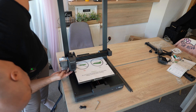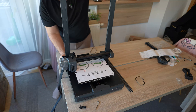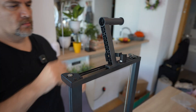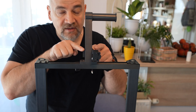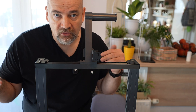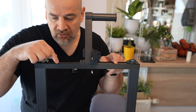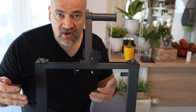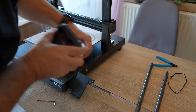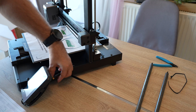It's time for installation. The nozzle is in the way, I have to lift it higher. Installing the spool holder — just a small lock. The holes are in the center of the spool holder part, but the spool itself will be offset to the right. To me it would be more logical if the spool were centered. We can use regular T-nuts since this is ordinary hollow extrusion, but this should be solved at the factory. The filament sensor position should also be aligned. Now installing the screen and the antenna for better WiFi connection.